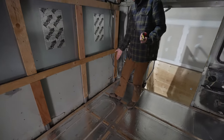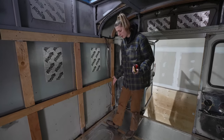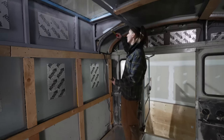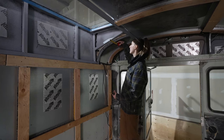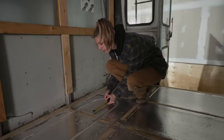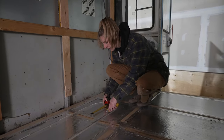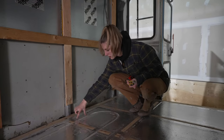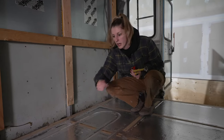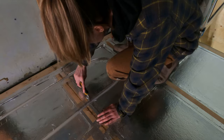And if we move it over a little bit, that's where our in-floor heating is, so we need to move that as well. So I think what we're gonna do is just measure how much we wanna move it over, which I think is 5.5 inches. We'll take it off the bottom here, like right there, and then cut this piece out, move this down, and then shimmy the pipe down a little bit. And then we can put a new board right here.